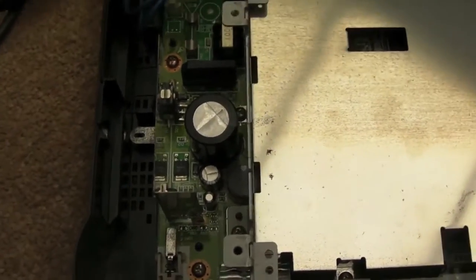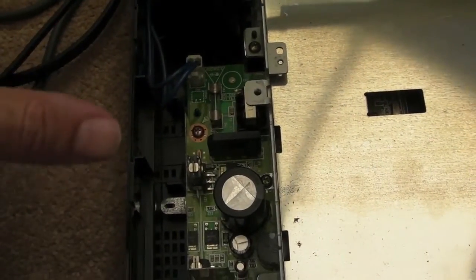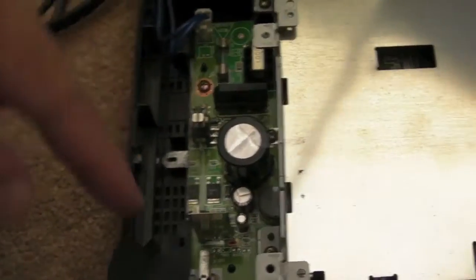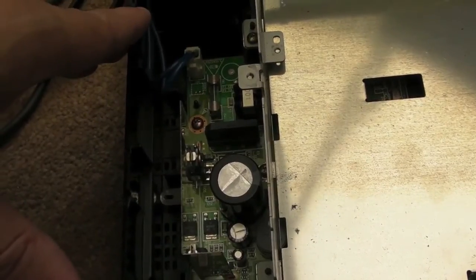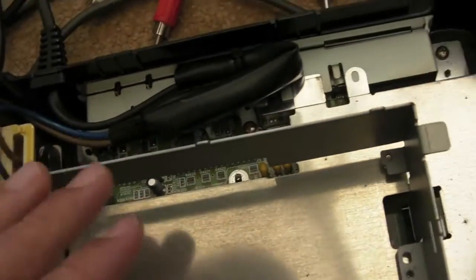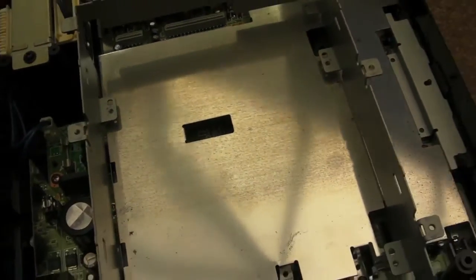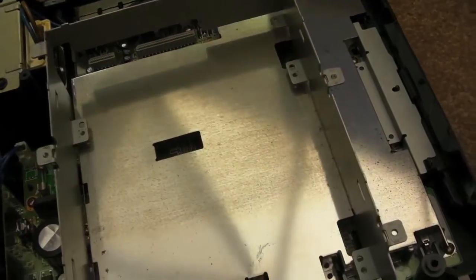I don't really want to do a full teardown of this, but I'll give you a quick look. You've got a power supply on board here, all built in. The mains lead is built in — you don't have a separate cable. It's fused. A couple of capacitors to check out if you get one of these and you've got faults with it. Caps are okay. I don't really want to take the shielding off here. There's nothing really spectacular on the main board — a couple of custom chips synonymous with the 3DO, designed for video graphics and the 3D.